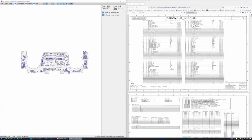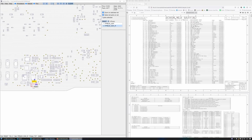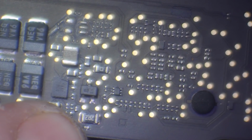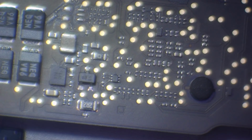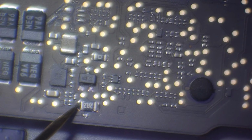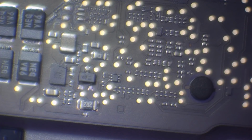Alright, so on this side of the board that we're on right now, we can go just down in the middle to a nice big resistor. Okay, that should be easy enough to find. Looks like it's going to be 2R2 just here. Excellent. So I'm in resistance mode. Let's just check the resistance to ground on PP bus G3 hot. 1.9 million ohms. Okay. Same with that side. So we're good there on PP bus G3 hot.